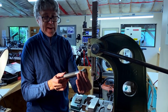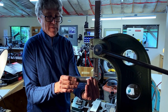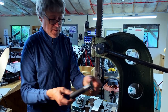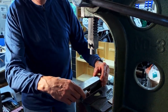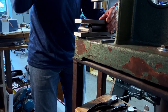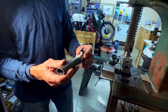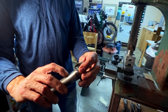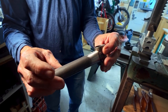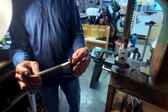The stem goes like that, so we need to ovalize this way. It's easy to get mixed up sometimes when you're ovalizing, so we're going to ovalize this way — squeezing this way. That's how far we want to come down; you can see it's quite a gap. I screwed up — I didn't have the ram in the right place, and the blocks exerted some force on the tube and you can see how I screwed up the tube. I made a mistake, so I had to find some more tubing and start over again.